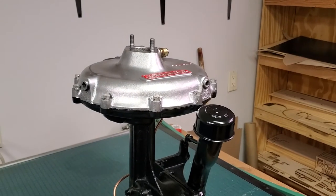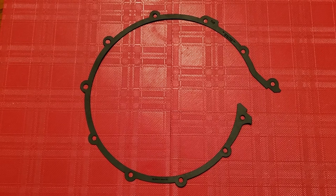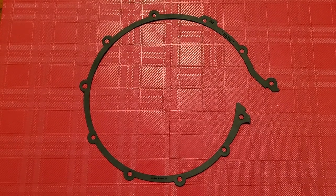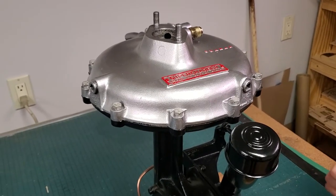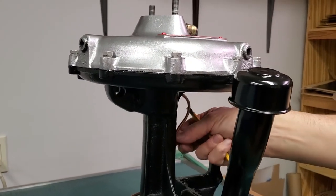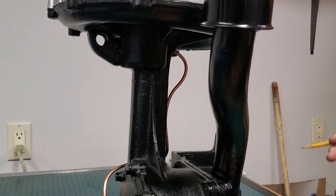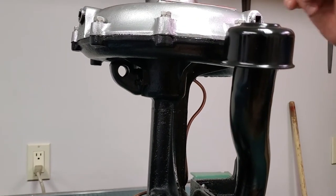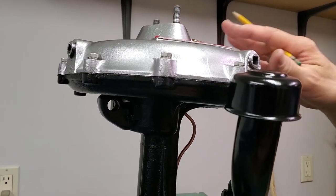When I got this one, the top area was sealed with a gasket that we made, but unfortunately the owner had used silicone with the gasket. That is absolutely the wrong material to use to seal any of the gaskets on a Graham supercharger, for two reasons. Reason number one: silicone, if it comes loose and gets into the system, can clog the very thin copper line that feeds oil to the top of the supercharger. A single little piece of silicone can clog that line and within seconds you will destroy the supercharger.